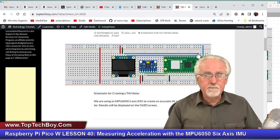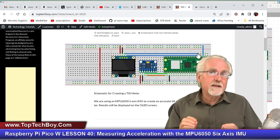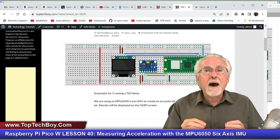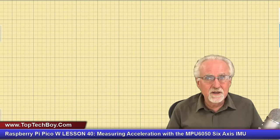Now what do you do with the MPU6050? Today I'm going to show you how to use it to measure acceleration in the x-direction and y-direction. Before just loading a library and coding, I'd like to show you a bit more under the hood about how this chip measures acceleration. How can you use an integrated circuit to measure motion? The key is a field that started developing in the 1980s and 1990s called MEMS — micro electromechanical systems. I was actually part of doing a lot of the foundational and original work in this field, so I have a lot of interest in it.